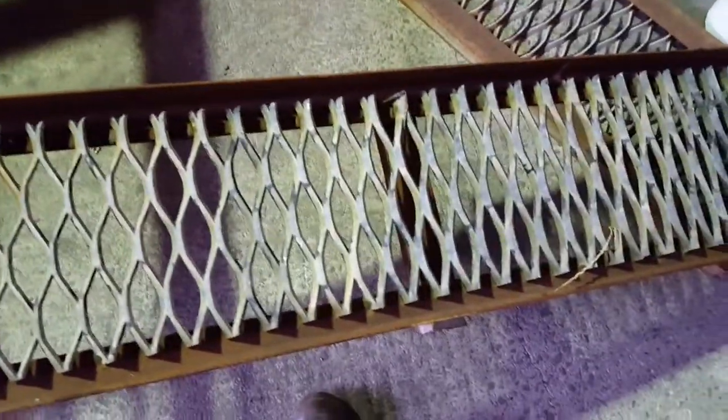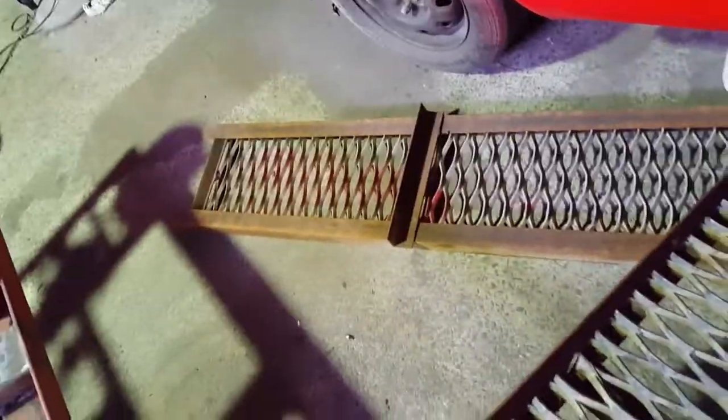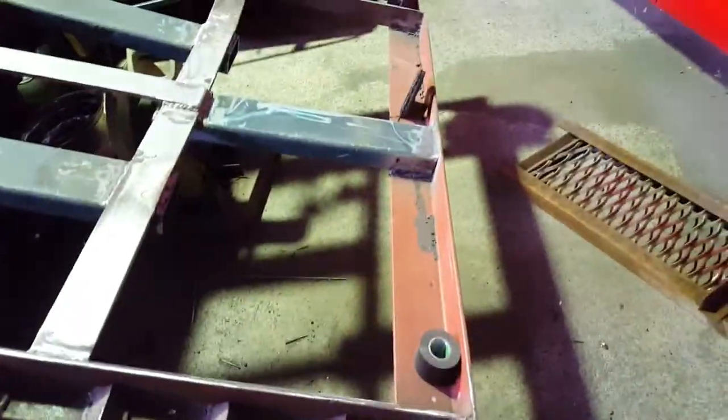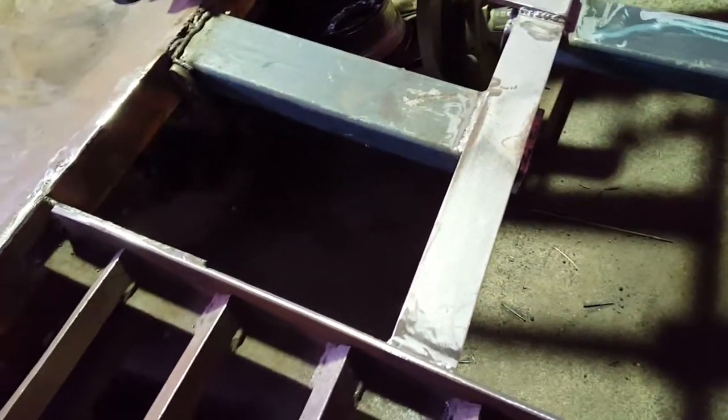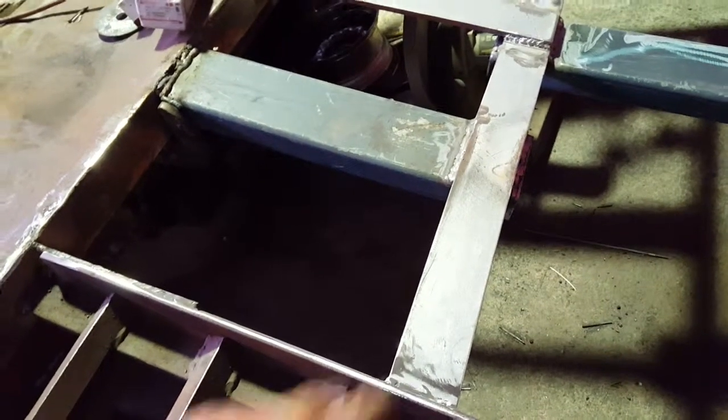All I've got to do is put some supports in — they were just going to be run as in a car trailer. A few supports, a few more welds, then down the diamond mesh — pieces of plate — and the ramps will be sweet. Make a nice smooth transition on the end of them with a bit of steel hanging over. Got to grind up, finish and tidy up all these welds, fill up some gaps in different places, and run one more support through to the underside of the middle of the tray.